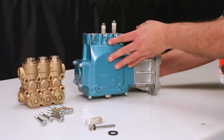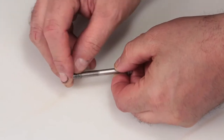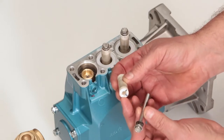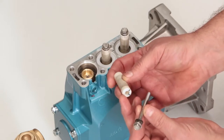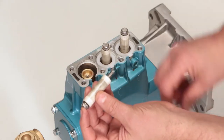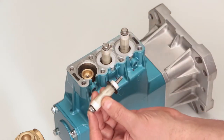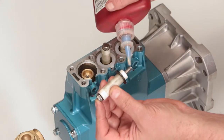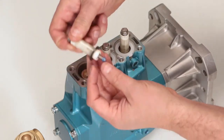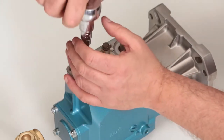To reassemble, replace the gasket on the end of the plunger retainer. You will notice that one side of the plunger contains small grooves — this side goes towards the pump's crankcase. Insert the retainer into the plunger, followed by the barrier slinger. Before installing the plunger assembly, apply thread sealant on the end of the plunger rod. Install the plunger assembly and tighten using a 10mm wrench. Torque to specification.